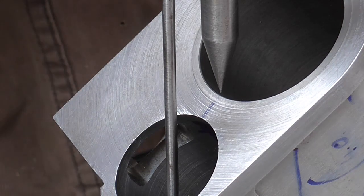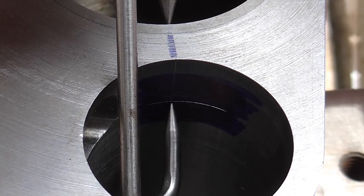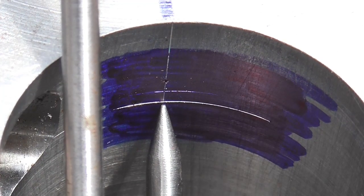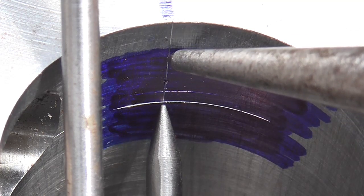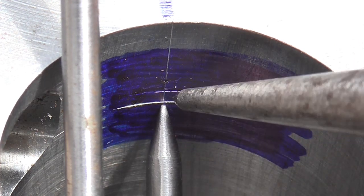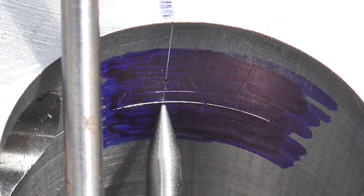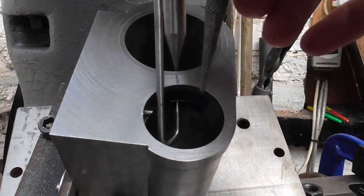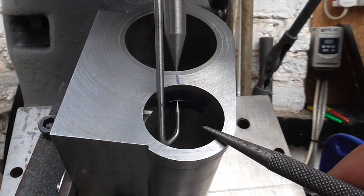I'm going to bring this point in — we're right over the top crosshair now. All that remains is to wiggle this up into position, and if we zoom in you can see I'm right on the crosshair. There's the centre line one way, there's the other centre line, and that little line signifies where the top of the slot is going to be. So this crosshair is right on the centre line of the slot — top, bottom, down there, and then side to side over here. I'm happy with that. You could actually use this point method to set up the whole operation, but I'm going to show a slightly more accurate method and also a method you could use to measure the slot.